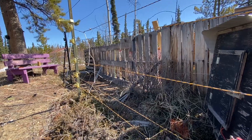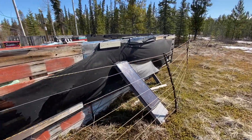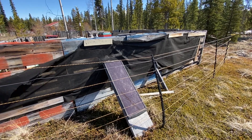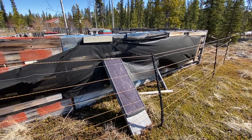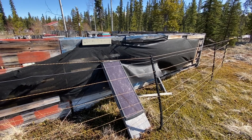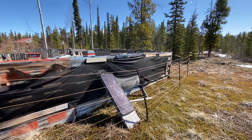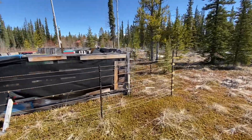For those in Canada — this is a 15-watt solar panel. They were on sale for 50 bucks at Canadian Tire and I bought two of them. I'll give it a wash — there's a bunch of bee poo on it. It's just facing south and that's enough to keep my battery from discharging. Last year we had issues with a lot of cloudiness, so towards the end in September my battery was getting discharged and I had to pull it out and recharge it.